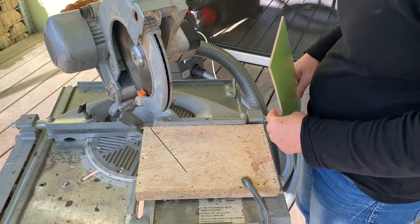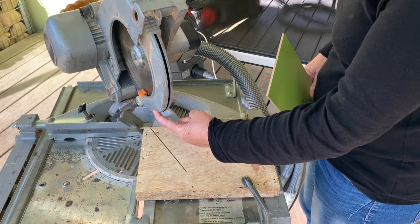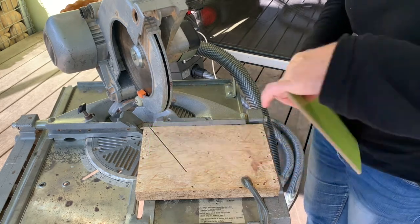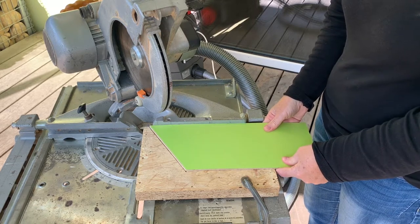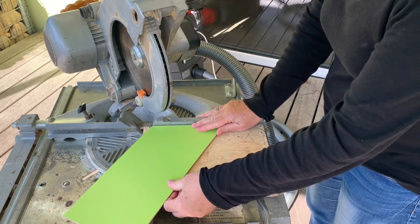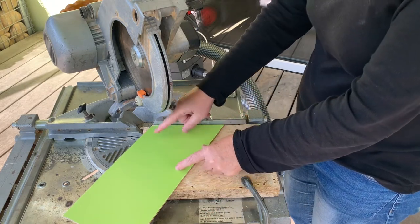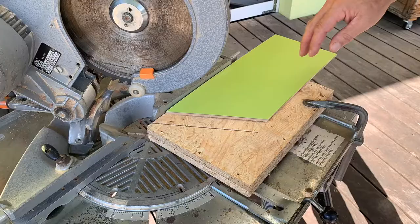Now to cut the base of the bowl, we've turned the saw to a 30 degree angle again. We can put this on here and cut down a 30 degree angle, which would then look like this. We're then going to take this and turn it round like that — we've got to see that the corner fits into position, and then we can saw again down there. Then we will have a triangle, and we can fit the triangle into the base of our bowl.